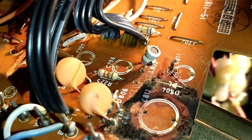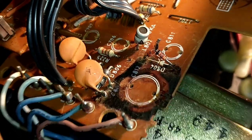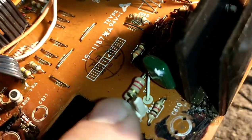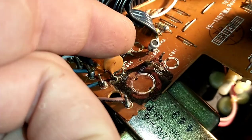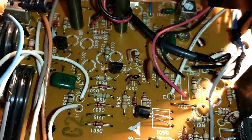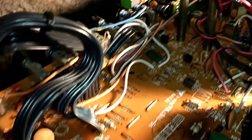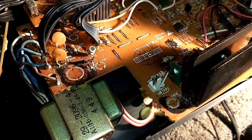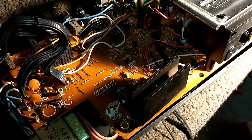There it is — we've got two 5.1s in series, making it about 10.2 volts. It's pretty close. I scraped the glue off; look at how badly the board got stained. Cleaned up the leads on that capacitor. There's no more of this stuff creeping around — it was just in the power supply section. So we'll get back to repopulating this thing, solder everything up, and see how it goes.